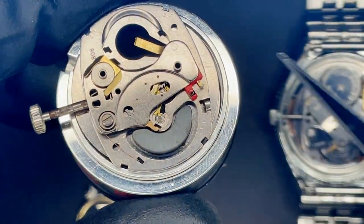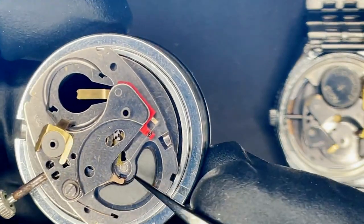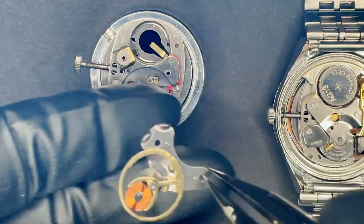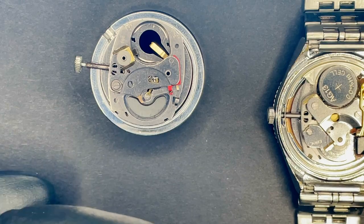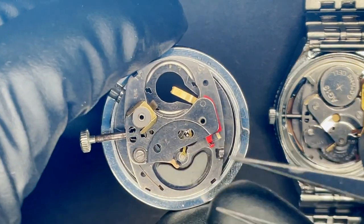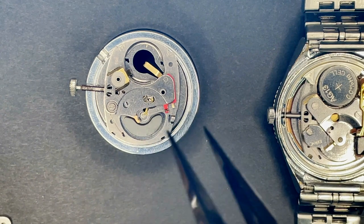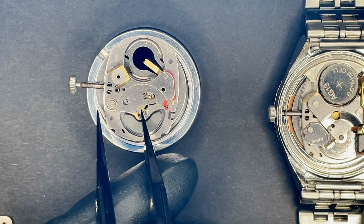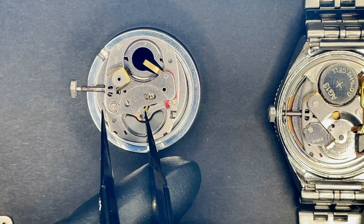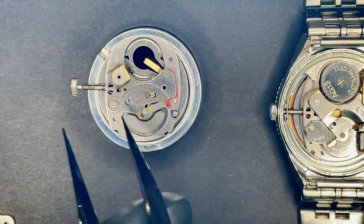It's hard to see, but you have something here that looks like a pallet fork, and it's actually very similar to the pallet fork in a mechanical watch — you can see it swings back and forth. As this rotor swings back and forth, there's a little pin there that makes contact with that wire I was talking about. There's another pin that knocks that pallet fork kind of thing back and forth. And there's a gear up here with these sharp serrated teeth — as this thing goes back and forth, it moves that forward, which turns the gear train.